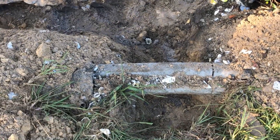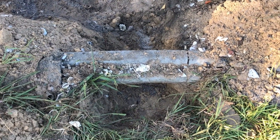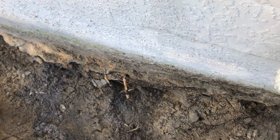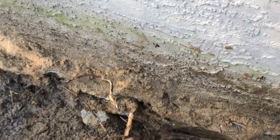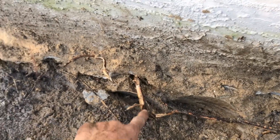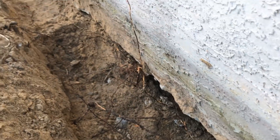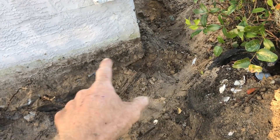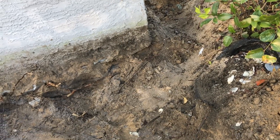Here's another quick example of roots causing problems. You can see we went underneath their concrete edging right over to the foundation wall, and there are viburnum roots growing right underneath and through the foundation — a big breach right here. We'll cut all that off and seal it up. Notice I created a much wider tunnel here because the downspout drain is separate — we don't want that downspout water coming back along the foundation. So we have two lines coming out, and we may join them and send one line over the hill.